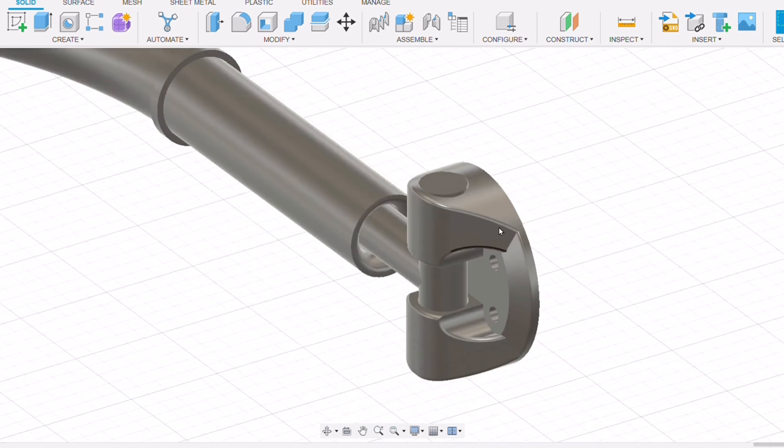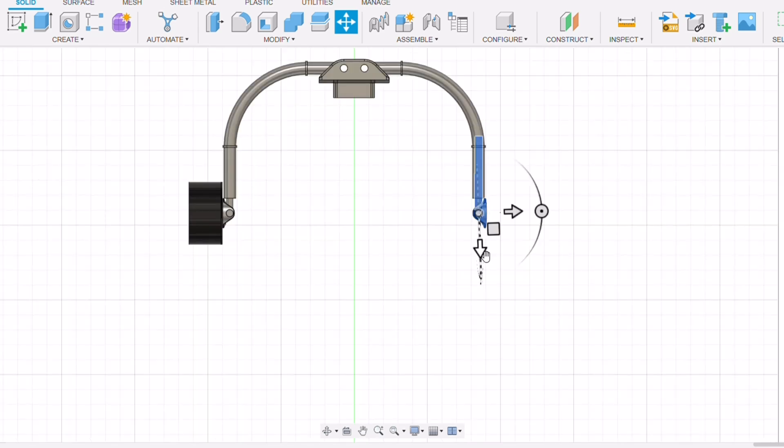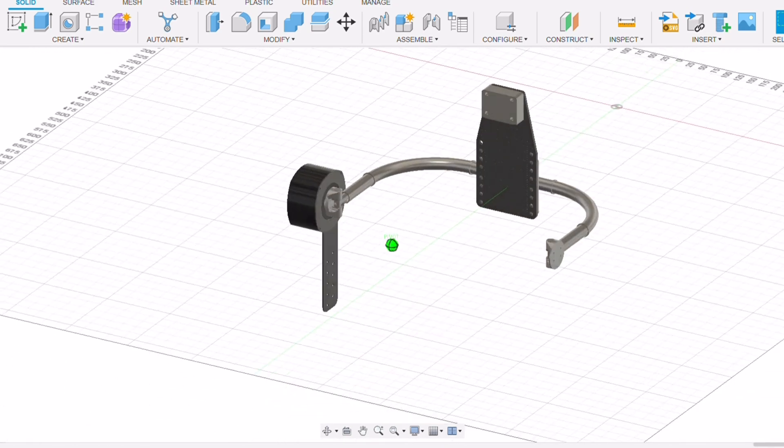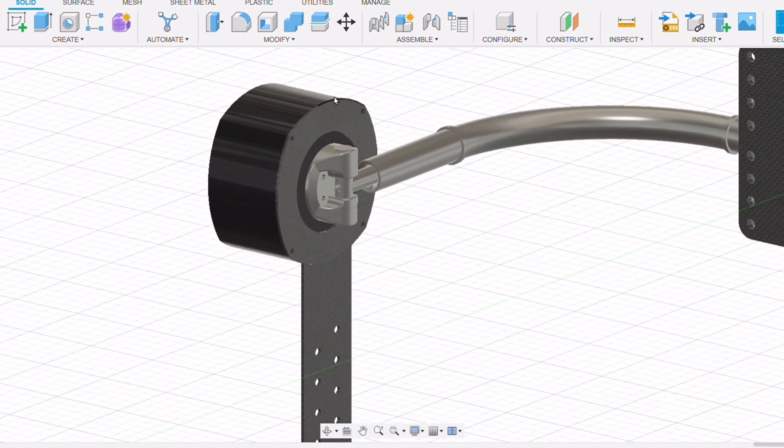The idea is that it can pivot back and forth on this T-bar while also being able to rotate the shaft and provide movement that way. The T-bar will be attached to the actuator, which attaches to the rest of the exoskeleton brackets for the legs. The legs can then be fitted onto the operator and the shaft can be slid into the pelvis pieces when you put the top half of the suit on. Once strapped up, the shaft is long enough to stay secure while still providing extra movement by being able to slide in and out to a degree. All of these joints combined should allow the leg exoskeleton to move around the operator's leg, each joint providing a different angle for rotational movement, while being completely vertically load-bearing and reducing complicated or dirt-prone parts.